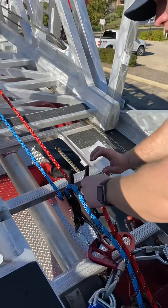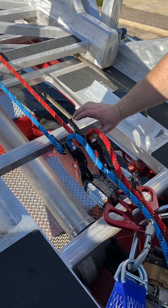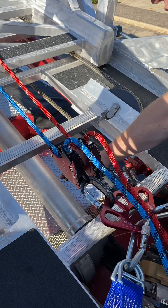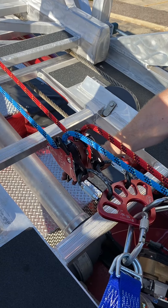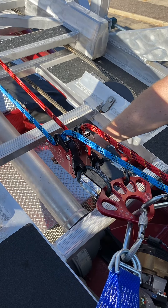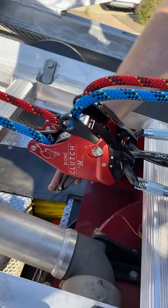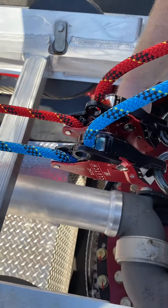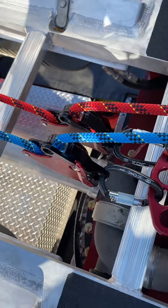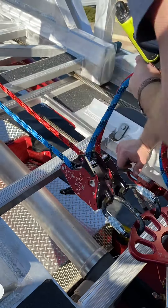With the clutches, we can do this one-handed. I open up my levers, flip them over, and with both hands I am feeding the rope out. I'm keeping equal tension in both levers and watching my tracers — the two black and gold tracers on either rope. As I open up the release, I'm kind of helping feed it through. If we had a live load or victim in there, you would see it pull a lot more. We're pretty much on the ground right now, so I can put a little more tension in the system and we can start over.